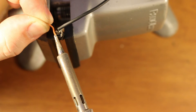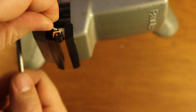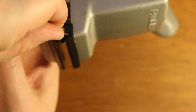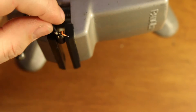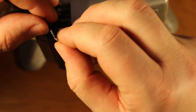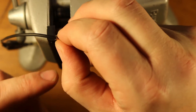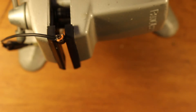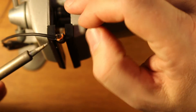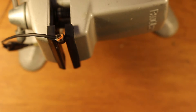For this jumper, I'm just going to use a little piece of extra wire from other projects. You want to use something fairly small because you're jamming a lot of things into a very small connector, especially if you're wiring all five pins. Soldering the jumper pin — I forgot the other end was going to get hot. I'm going to flip it around for easier access. I'm going to tip it in the direction I need to go, sort of under these other wires, and lay it where it's going to land. Then do some left-handed soldering, and there you have it.